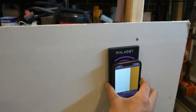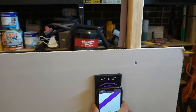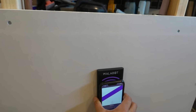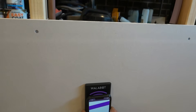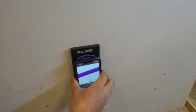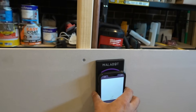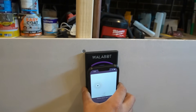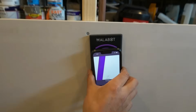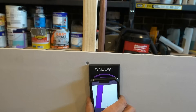So we've got our PEX pipe here. You'll notice it goes blank and then we're going to pick up our pipe. The reason for that is I've got a big bend on this pipe here so that we can actually trace it. If we follow this one here along, you'd never expect that the pipe is running there — it looks like it's running straight down, and I did this intentionally so you guys can actually see how easy it is to trace. We'll come up to the top and we've got our copper pipe right here. Now this one here doesn't actually differentiate between pipe or wire — it just says it's one or the other behind there, which is enough to tell you don't put a screw or drill straight through there.